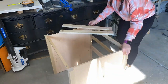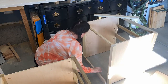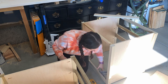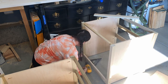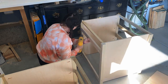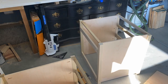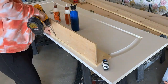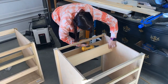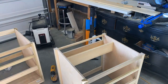Now I'm going to add a really thin spacer to the back just to square up the whole frame. I'm not going to be building a back for this table because I need airflow for the CPAP, so I'm going to add a couple of cross pieces to keep the whole thing square. Now I'm going to start working on the CPAP cubby. I'm using a 1x8 and a 1x6 to make an L shape with pocket holes, and then I'm sliding that in and pocket holing it to the side frames to create the cubby.